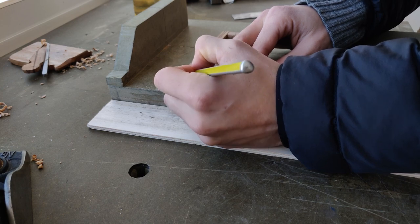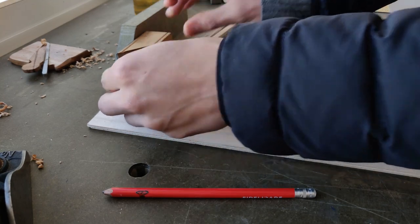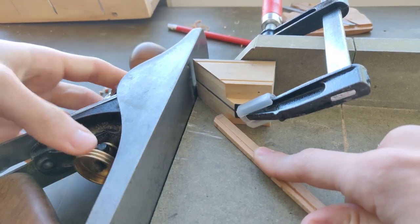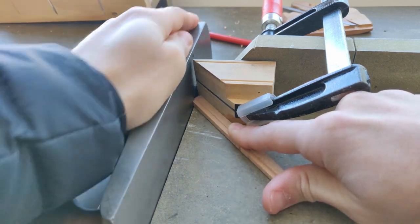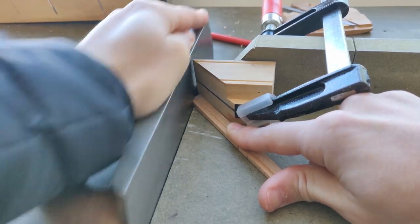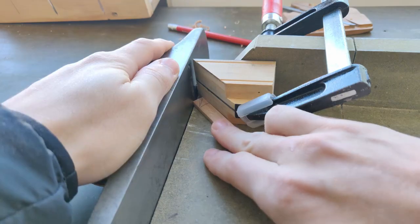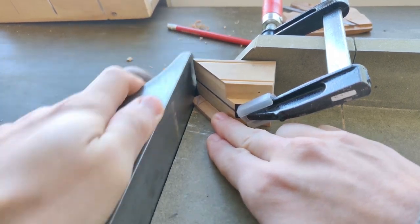So I make a cross cut, and then I'll draw in all the miters, just have a visual guide. So this is like a little 45-degree attachment for the shooting board — just adjusting the plane a little bit. It was actually a piece of discarded frame from a picture frame shop that they just left outside, and I just cut it in half and glued it together, so it makes a 45-degree angle. And so I'll nibble away at it until I get to my line, essentially.